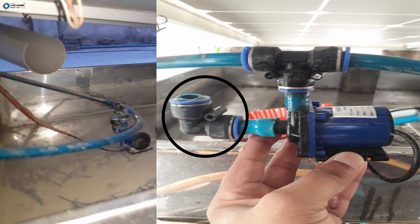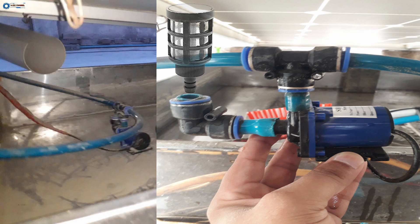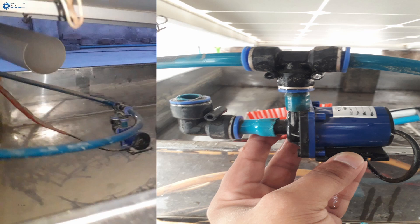You are also seeing the pump suction side, where I use a PU elbow. This elbow performs many functions — for example, we can add a small filter at this point. Another function is to prevent the water pump from burning. These pumps are submersible, and if you run them without being submerged they will burn with heat. So the elbow stops the water flow at suction, so the pump will turn off when no water is going into it. This pump has a sensor in it and will not run without water going in.